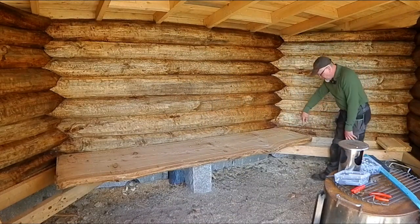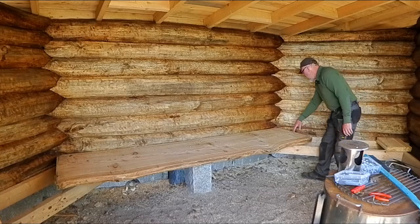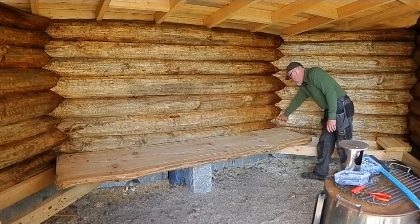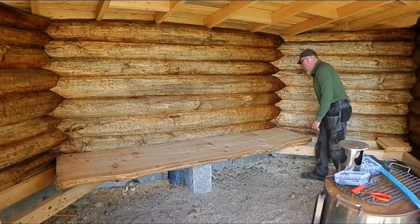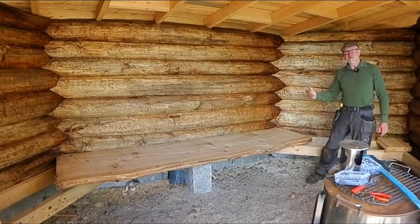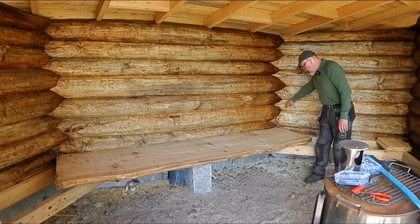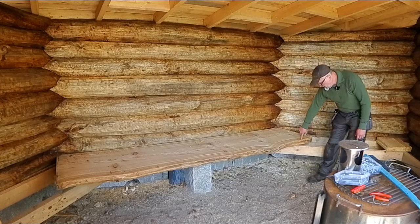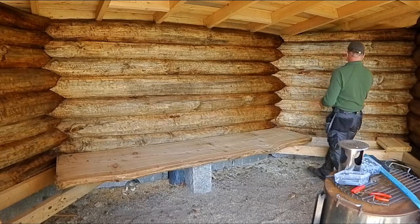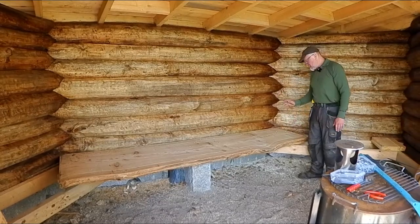And that means that I can then find out the point where the edges meet. Draw that point, have the point that I want to cut to marked on the back wall, that's my mark there, and I can draw that line, cut that, and then put it back in and use that as a template to draw the line on the bottom plank, and then take everything out, cut it, put more back in. Then you get a nice line, a nice angle where the edges meet, which they wouldn't otherwise, because if you were just assuming this is a 45 degree wall, so we'll do a 45 degree cut, you're dealing with planks of different widths, so they wouldn't meet up at the edges, but this way they do.